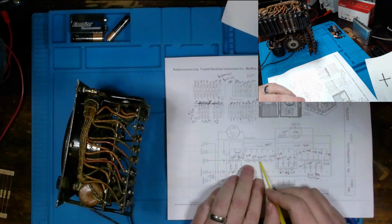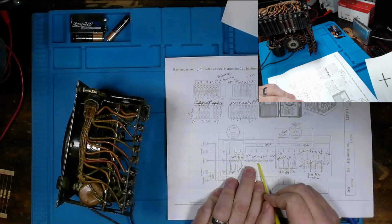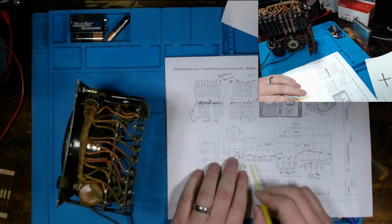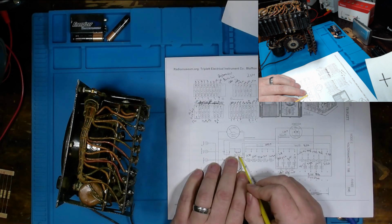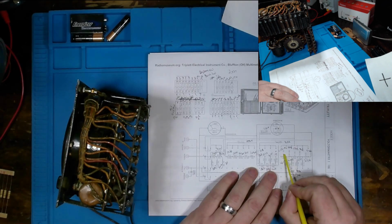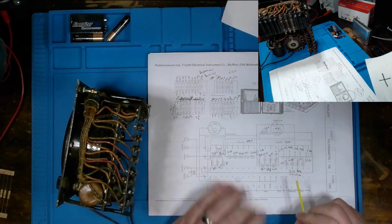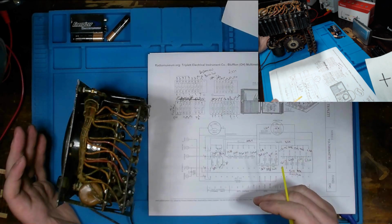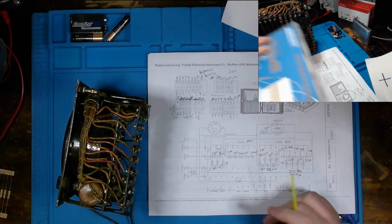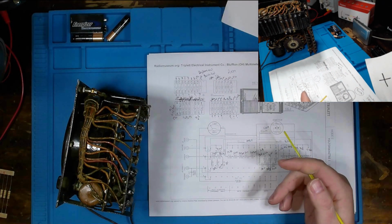But you see their values are often pretty specific. Well, maybe not these within our circuit here: 1 meg, 350K, 100K, 35K, 10K. Those will be fairly easy to find a replacement for. But when you get into these very specific values like 9.331K or 933.1K, those values aren't something that you can readily create yourself with your traditional packaged resistors like you see here. It's not something you can do.